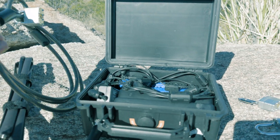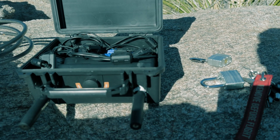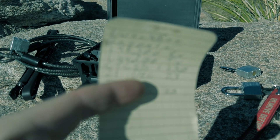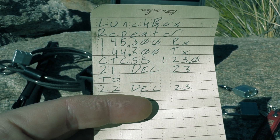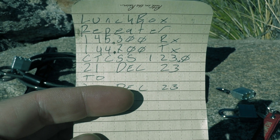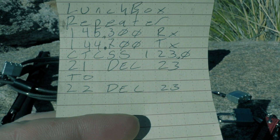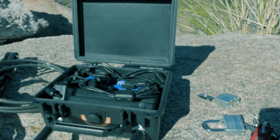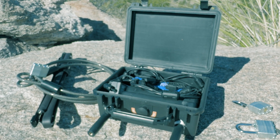I don't have the best locks or cable on here, but it's mostly just to prevent people from walking off with it. What I like to do is leave a waterproof note — in this case, just what it is: the lunchbox repeater, the receive and transmit frequencies, the CTCSS tone, and the dates it's going to be up here. That way, if a game warden or ranger finds it, they know it's not going to be here forever.